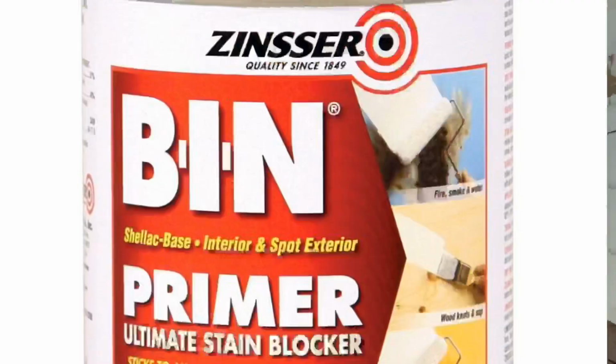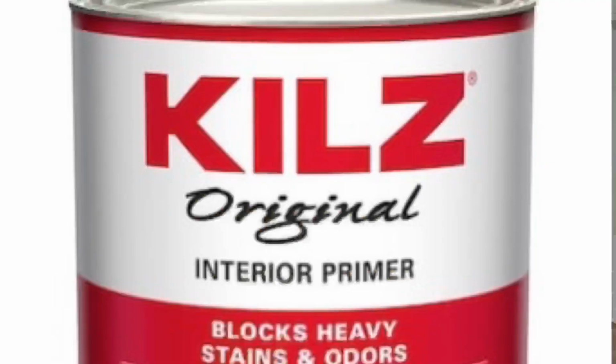Another product you can use is Bin. B as in boy, I as in Ida, N as in Nancy. Bin. And that's from Zinsser. It's an alcohol-based product. Those are three products I just gave you. Let me give you one more. Kilz, K-I-L-Z, the original. It's not an offensive odor anymore.